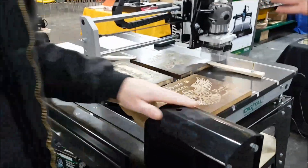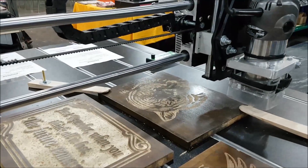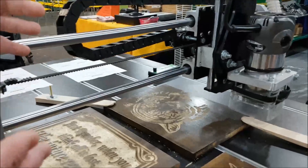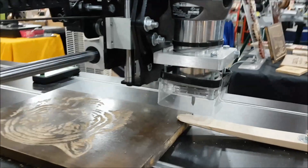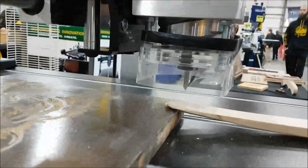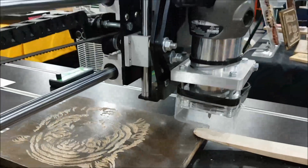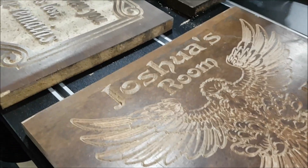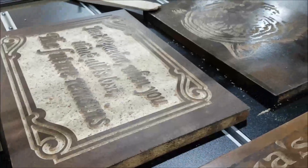Leading to a common question that I'm sure you get — I know I get a lot — is: what are the most popular bits? When I get a CNC for the first time, what bits should I get? I always recommend that a user have at least two V-bits, a 60-degree and a 90-degree V-bit, at least a quarter-inch upcut spiral bit, and then two ball nose bits for your 3D finish work — at least an eighth-inch tapered ball nose and a sixteenth-inch tapered ball nose. Those 5 bits will do 90% of everything that you want to do.